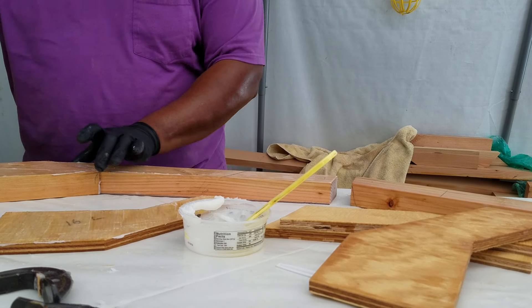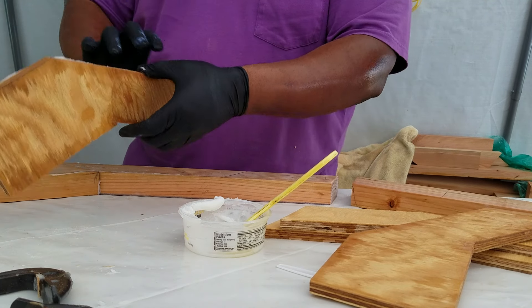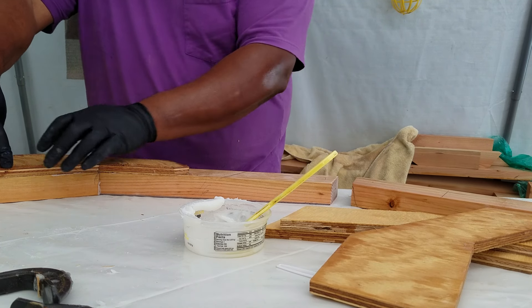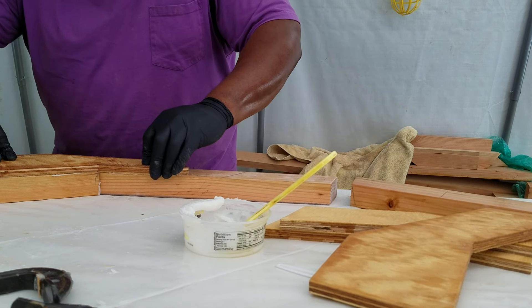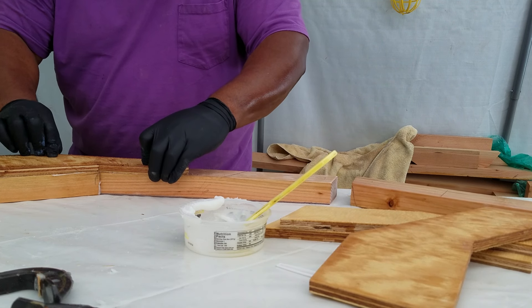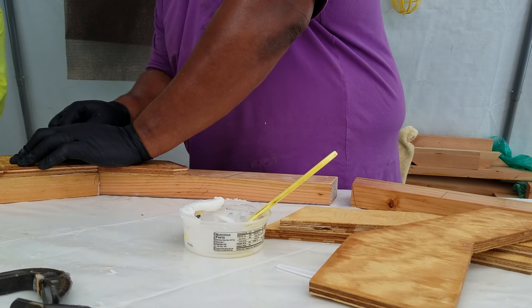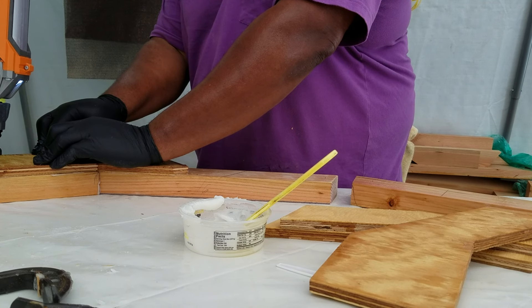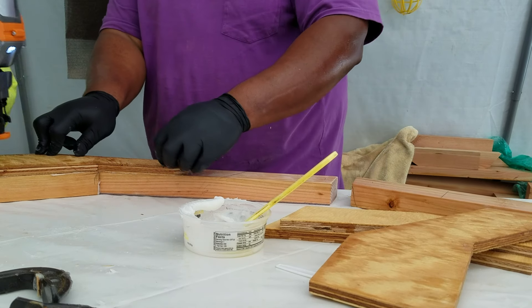So we want to confirm our joint. Put that on top and shimmy it down. Check my edges to make sure they're flush with the wood. Because the gusset doesn't matter, but you don't want it to overhang because that's just more sanding you'll have to do later on. So we put four nails in on each side and we stay clear of the joint.